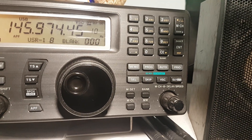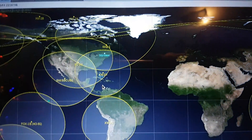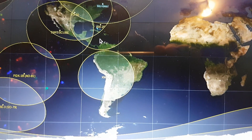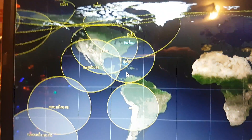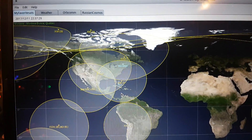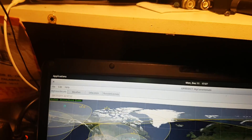I still don't hear it, but we are going to soon hear the beacon. The downlink is just above, from 145.980 to 146.000 — they are all 20 kHz wide, basically. So it's always above the beacon at 975. As soon as I hear the beacon, I start tuning around above.